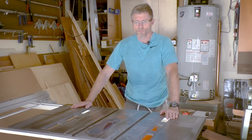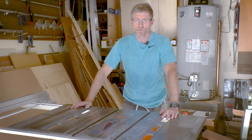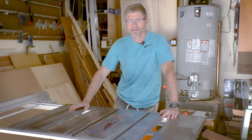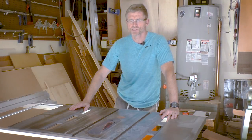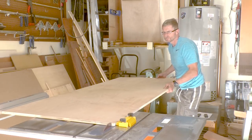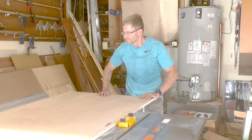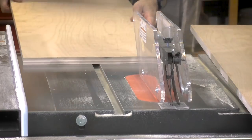I'm really glad that I still have this table saw because my old table saw has a ripping capacity of almost 37 inches, whereas my new table saw can only rip up to 26 inches to the right side of the blade. So I'm going to use this to cut the wide panels for the back, which is going to be 33 and three-quarter inches. I could use a straight edge but it's not that precise — it has a little bit of flex and it's really meant for cutting drywall, not woodworking. The saw that I bought was the Grizzly 1023RLW and I really like it. It's a 3 horsepower saw with a lot of power, but it tends to be a little less practical than the rigid saw I was used to because of the ripping capacity it lacks.